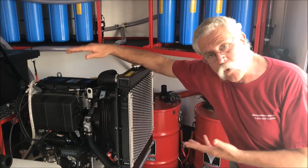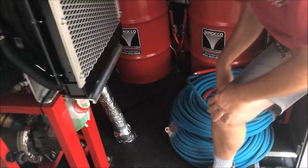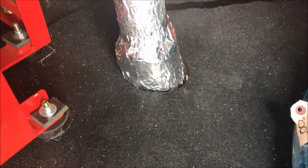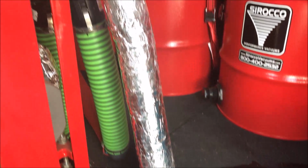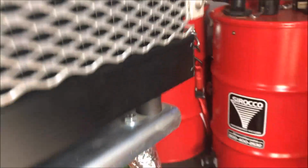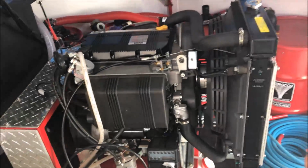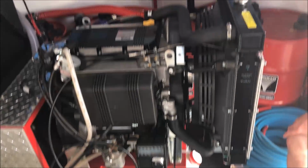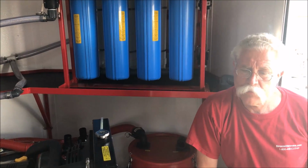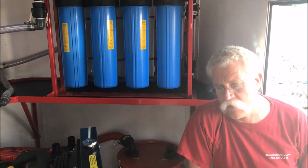And everything's been quietized. Here's another insulated exhaust line going down through the floor to another muffler for the engine. This is how to make these things quiet. Wrapping it so nobody can get burned, obviously, is an intelligent idea. This is just planning ahead so your guys can service equipment while it's running, not worrying about burning themselves or catching themselves on sharp edges. It's pretty important. Making things serviceable on the fly is the rapid elimination of downtime.